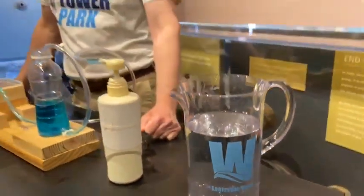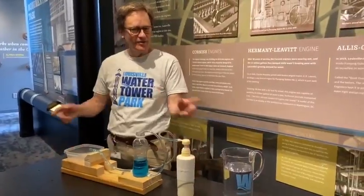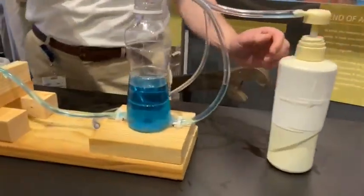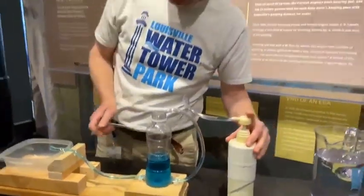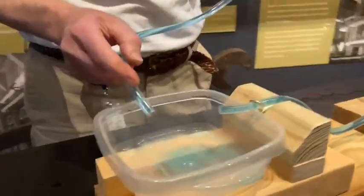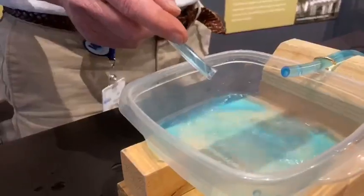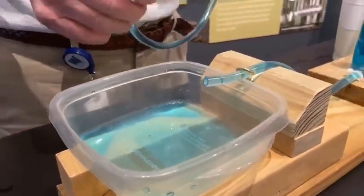Now that you've learned about how the Cornish pump works, we're going to learn why we have the water tower. It takes a little imagination here. This is the Cornish pump. This is the water tower. This is the reservoir where we store the water. When the Cornish pumps worked, when the plunger dropped, it would send a surge of water through the pipes and it would come out just kind of squirting. That's not good for the cast iron pipes — it would have broken the pipe, all that pressure surge. Because just imagine, there are like 400 gallons per stroke.